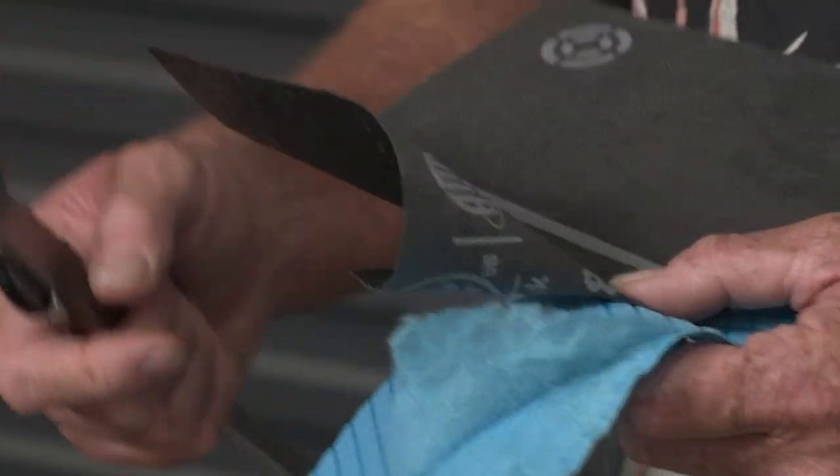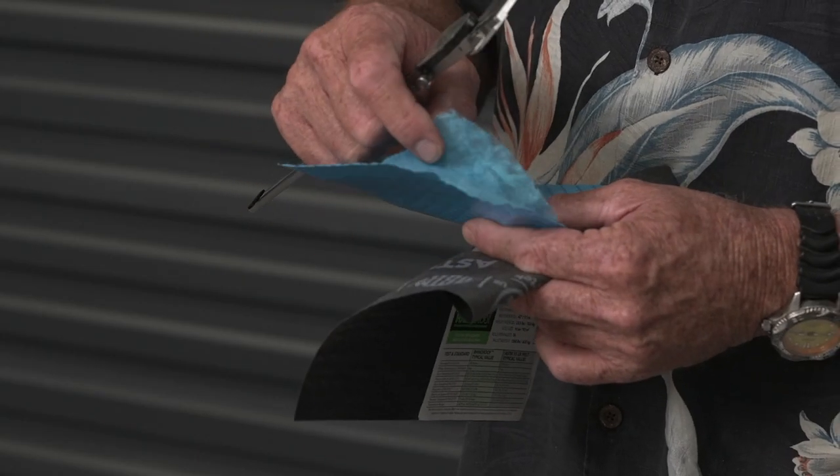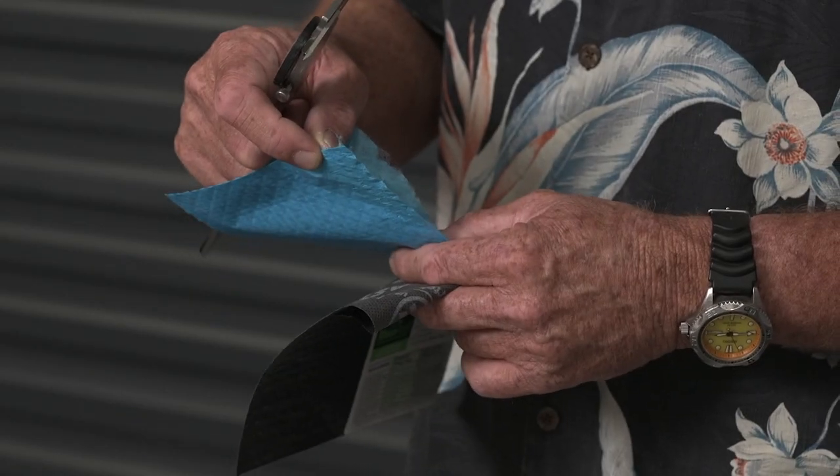This non-woven is really there just as a walking surface and it actually makes the product look thicker. But it provides no long-term moisture protection or durability — it's simply there to make the product look thicker. So it's really confusing when you believe you're getting a heavier mil product and you find out that the actual mil thickness is much lighter.